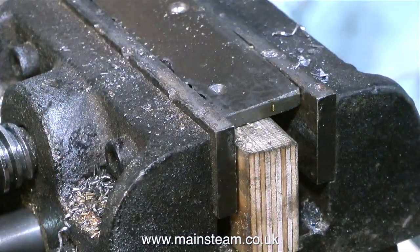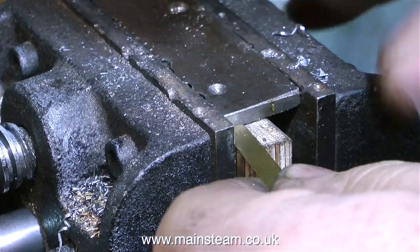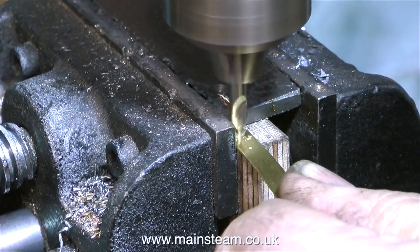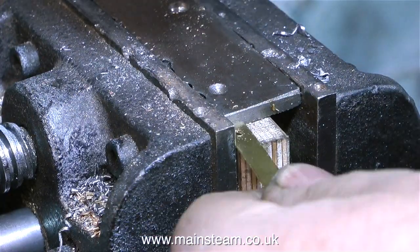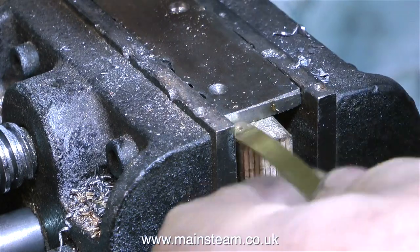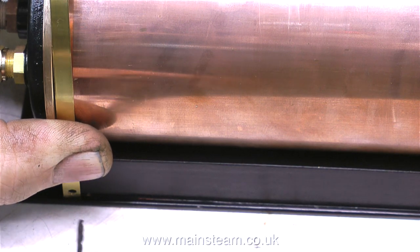In this clip I'm drilling holes in the end of the banding. You will notice that apart from the piece of wood in the drill vise that I'm resting on, I also have a piece of steel clamped in there very tightly. This allows for repeat positioning of the pieces of brass in the drill vise in exactly the same place, so therefore all the holes are in exactly the same place. Utterly simple, completely non-technical, totally unscientific and really easy to do.